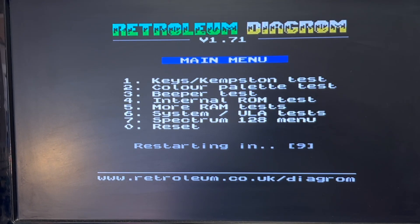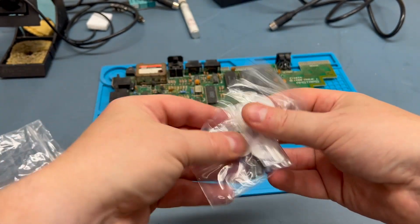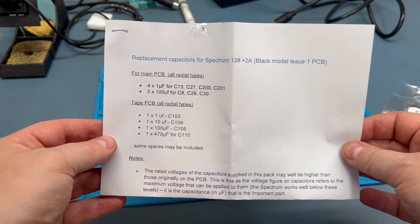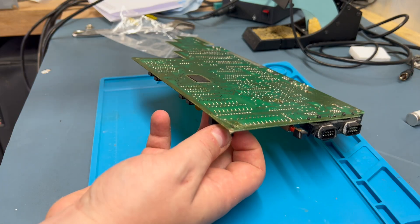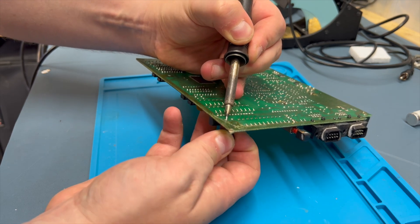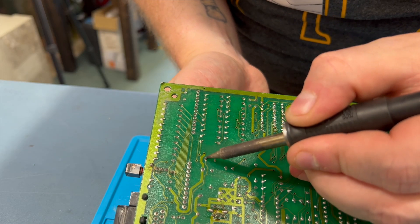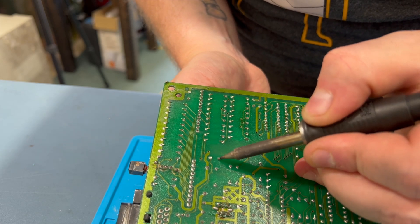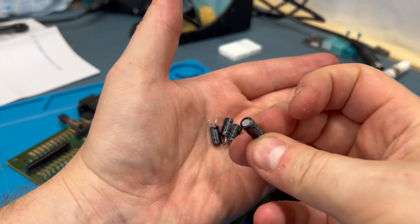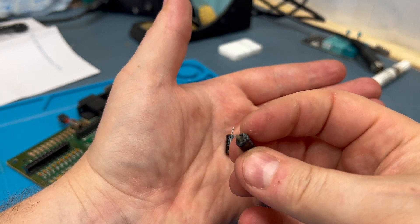Given we now know this machine works, I still think it's a good idea to swap out those electrolytic capacitors. I'll track these down via the cheat sheet provided with the kit and get the old ones removed. When recapping a board like this, I find it easiest to lever out the old capacitors first by heating the solder joint and applying gentle pressure until the legs are freed, then go back in with a soldering iron and manual solder sucker to remove the last remnants, giving us perfect holes for the new ones. Truth be told these caps don't look too bad, but it was only a couple of quid to source this replacement kit from Retroleum, so why not.